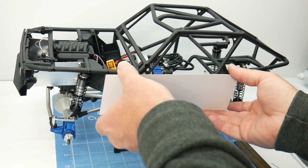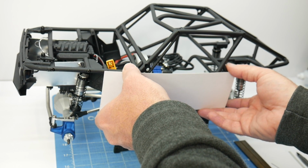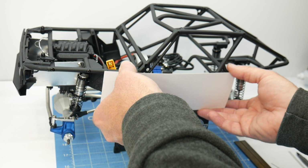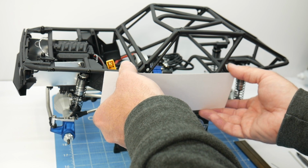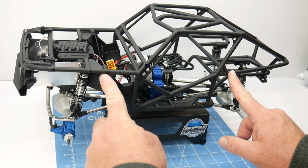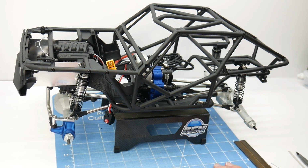Now that I've got the height of the panel exactly perfect, I can feel right up here with my fingers, it's rolled over the first third of the bar as well as the bottom down here. So it has a good feeling, and it won't actually hit your fingers or cut you when the panel is mounted on. Now we need to cut these angles. We can see we have one angle right here and also one angle right here, and we're just going to guesstimate on these angles.